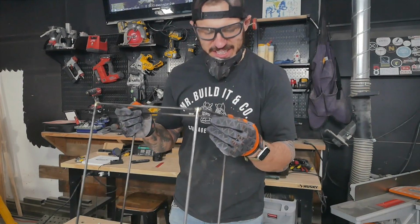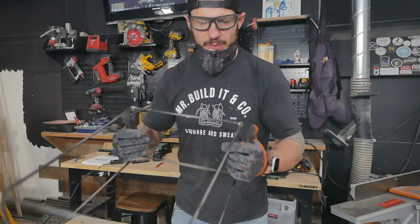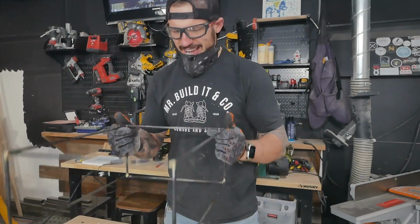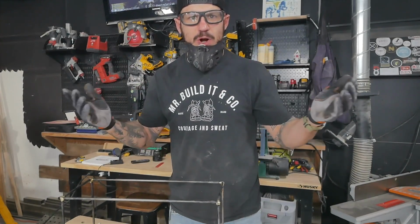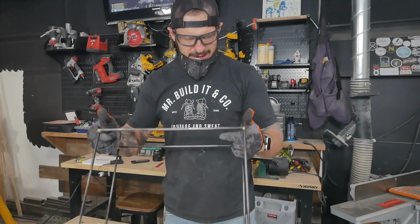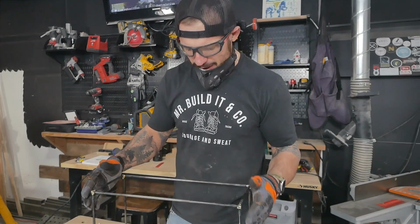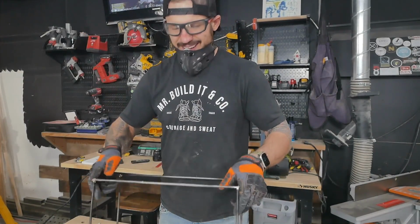You know, it's funny, I actually didn't have to grind much of what I wasn't happy with, the copper, how it was bulky and whatnot. I really just had to grind off the edges of the steel that I cut, so I'm actually pretty happy because the capillary fill pulls it in, sucks it in, and the top is kind of like a droplet of water would be. So pretty happy. What we're gonna do now is degrease this, shoot some paint primer on it, and then we'll start building the little shelf for it. And then, yeah, really good.